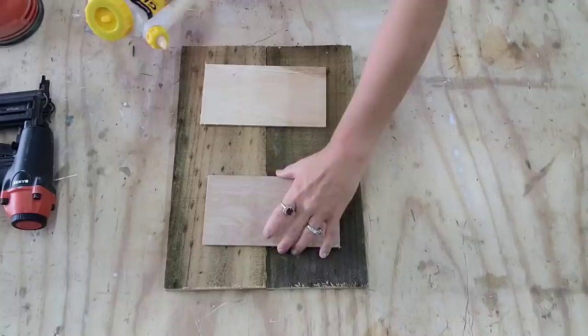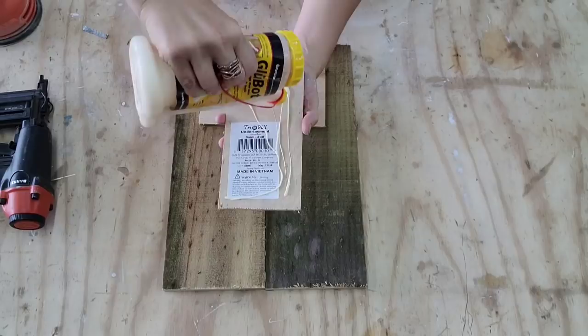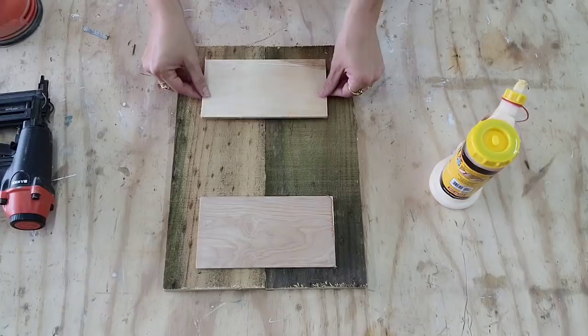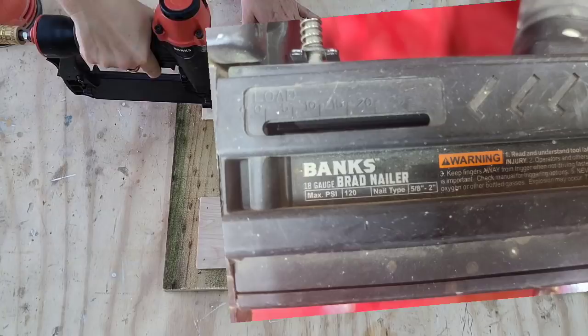To attach the two pieces of fencing together, I'm just using some smaller extra boards I have laying around. This is five millimeter underlayment and I'm just going to use glue and my brad nailer to secure these two boards together. When I'm using my brad nailer, you just want to make sure that you are using the right size nail for the job. You don't want a nail that is too long — that's going to go through your entire piece and into your work surface. If you look at the label on the side of the brad nailer, it will tell you what size nails you can use for that particular gun and what gauge nails you need.